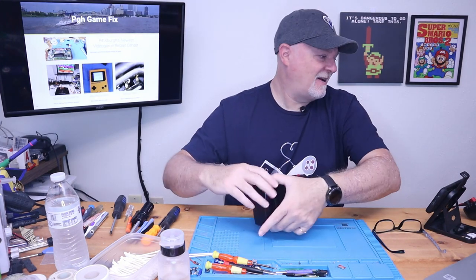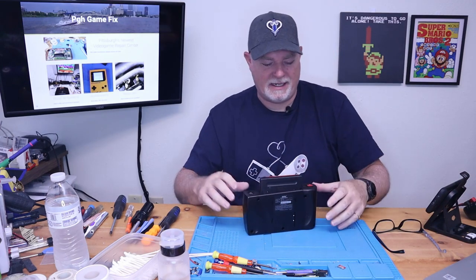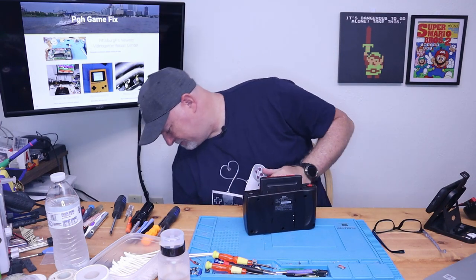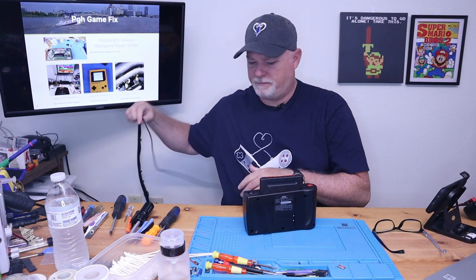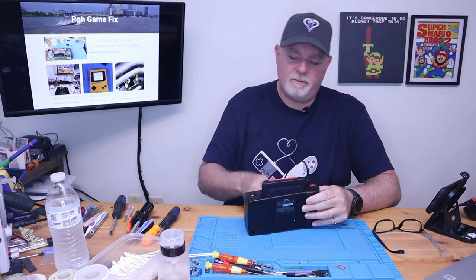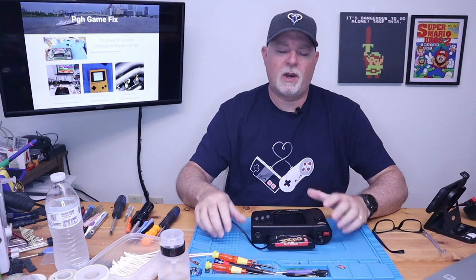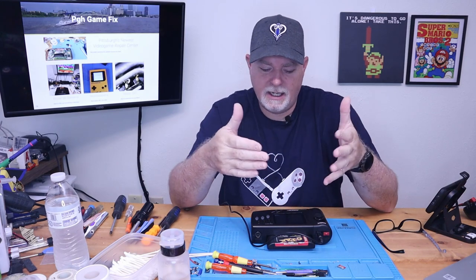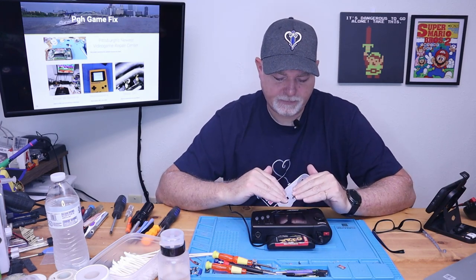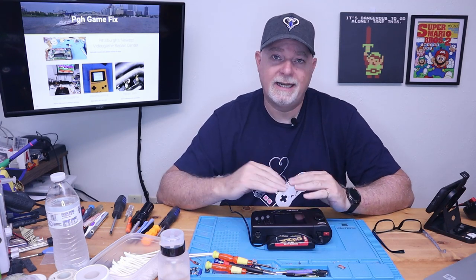So anyway, let's go ahead and give this one a test, to see if all those dead pixels are gone, which they should be. And now I know this wasn't a full install, but mostly the only part that's different between what I just did here and a full install, if it was an original screen, is that on the Nomad screen, the ribbon cable between the LCD and the main board, it's soldered on.